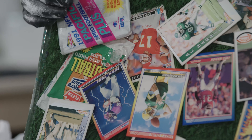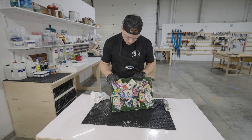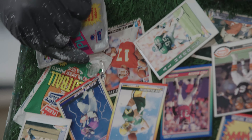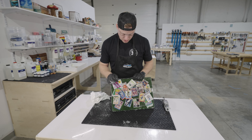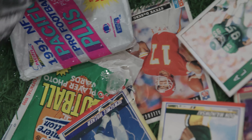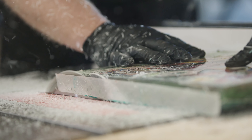Now that I have this thing grooved out, when you put the epoxy in you'll have virtually no bubbles other than your initial pour bubbles because it's bonding to other epoxy. Those blemishes will look brand new — you guys are seeing the finished product and you won't even be able to see this crater. Now we'll take it to the table saw and do the rip cuts to make it nice and square.